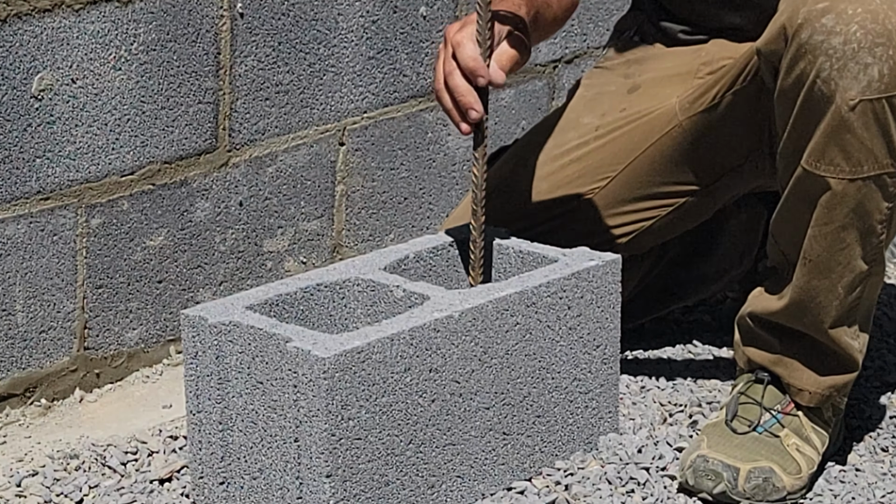Be good to go in about 6 inches with a 5/8 bit, a masonry bit, using a hammer drill. And you blow the dust out, and then you can use an epoxy and put that rebar in. We have the vertical reinforcement that's put through the cells. They're filled solid as you go.